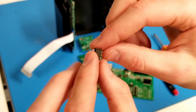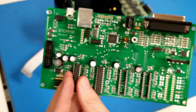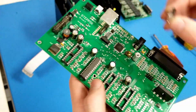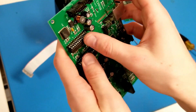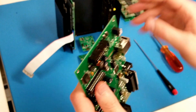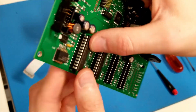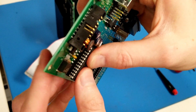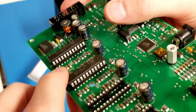One thing to note when reinstalling the driver chip: there's a little notch at the top that needs to face towards the back of the driver board. To reinstall, line up the pins on one side, then line up the pins on the other side and press gently. If any pins are getting stuck, don't force it — use tweezers or a tool to push them back into position. Once it's halfway inserted and no pins are bent, apply some force to push it in fully. You want it fully seated with none of the pins visible.